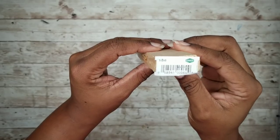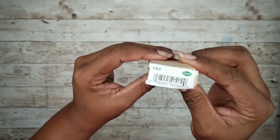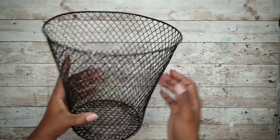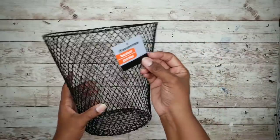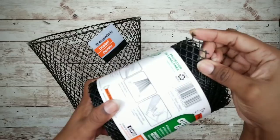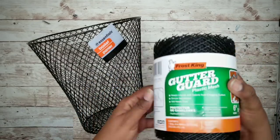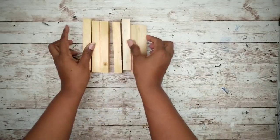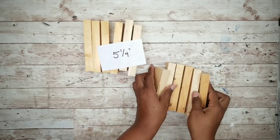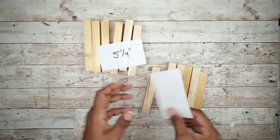The first project will be a 3-piece shadow box fall decor. For this project, we'll start with this 1x2x8 piece of $1 wood. We'll also be using a Dollar Tree wastebasket, or you can use Gutter Guard material from the home improvement store, which is a thick plastic mesh. We're going to start by cutting our wood down to size — 6 pieces at 5¼ inches and 6 pieces at 5 inches.